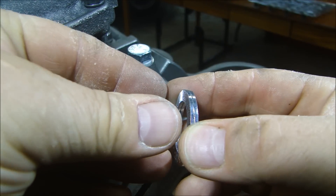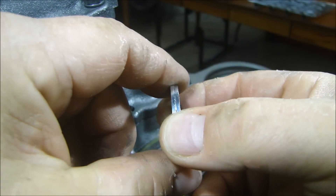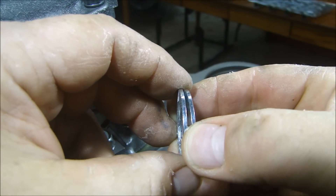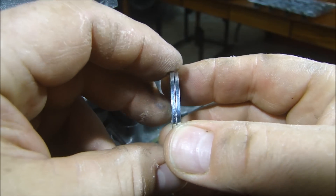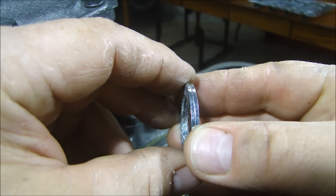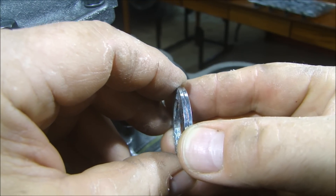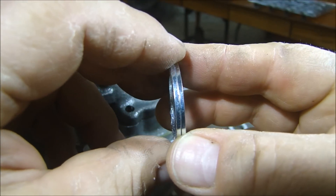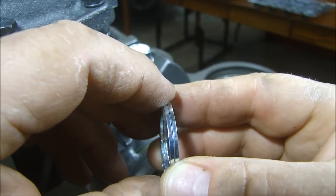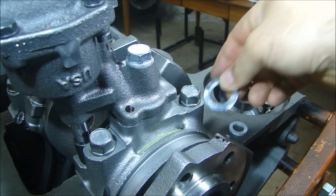On the inside, you can see there are steps in each piece, oriented in opposite directions. When you tighten a bolt down on this washer, the bolt head digs into one side and the other side digs into the substrate — the teeth point opposite ways. Here's the key: as the bolt starts to loosen, since the inner surfaces are like little ramps, this causes rotation. As it rotates, the washer starts to come apart — which actually tightens the bolt back up. So the awesome thing is that as the bolt loosens, the washer tightens it back up. It's incredible.